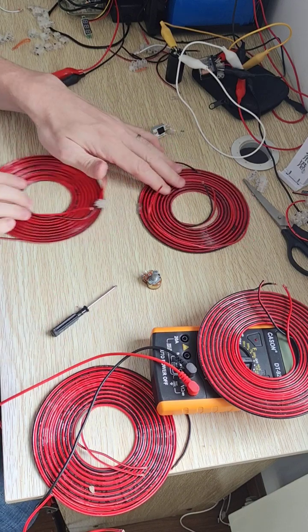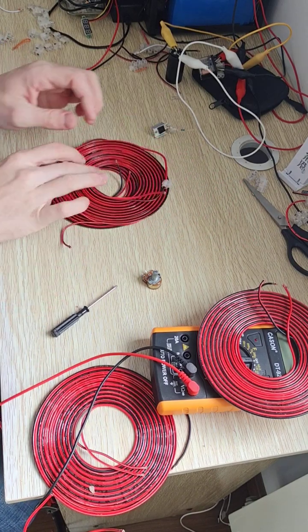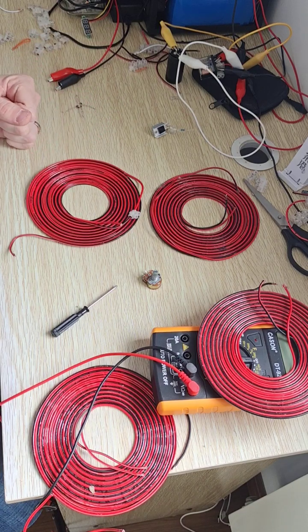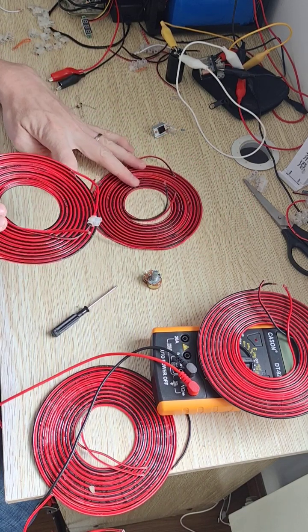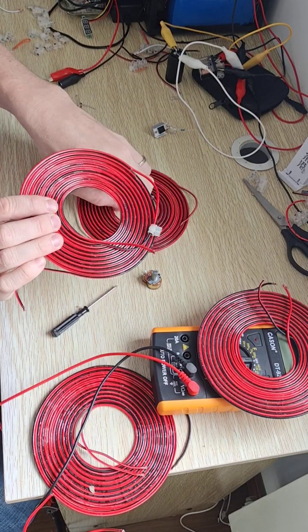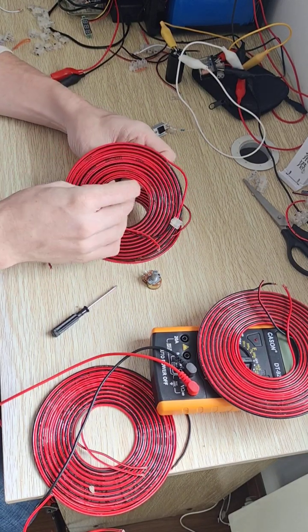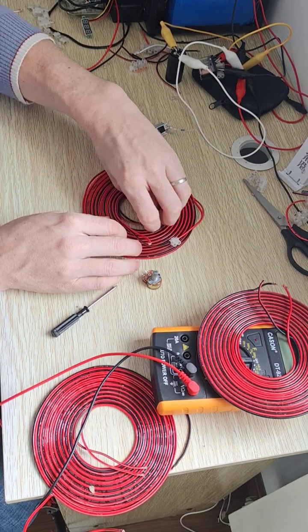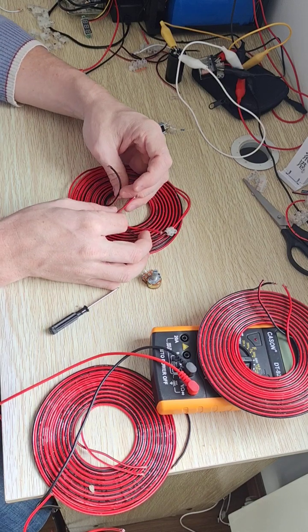So now if you were just going to put that on top of the driver, then you've got your 2 outs. And that would be that, same as before. So what I'll do is I'll put the driver coil, same orientation, they're both turning whichever direction, but they're the same anyway at least. So you put your 2 middle wires from the bottom coil through the middle there, you see. And you have to do your center tap again because this is the driver.